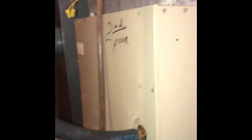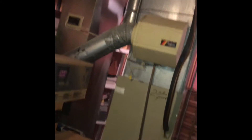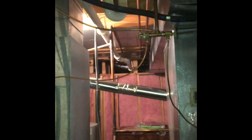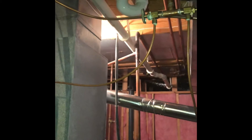That should be everything on the inside for this system. Oh — a humidifier. We're going to do a new humidifier. We'll mount it to the supply side and bypass over to the return side, or just do a powered humidifier because there's more than enough room. There's a shutoff valve right there, so we should be able to tie onto that existing shutoff valve, unless we want to solder a new one on and run our water line back down.